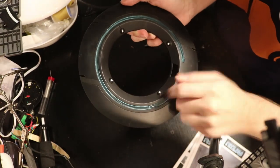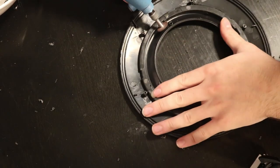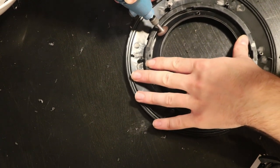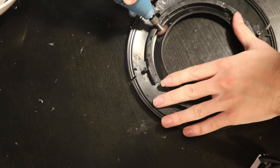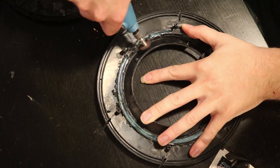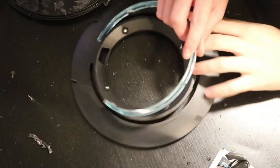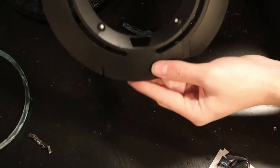The next thing you have to do is take out that original C-ring, because it doesn't diffuse light well. From the way it's designed as a toy, there are only like four sections where the original LEDs go in — literally like four or five LEDs for that entire C-ring, which is ridiculous. We're going to be replacing them with NeoPixel later on. So I went around in circles and really got rid of all of that plastic until the ring popped off. I unfortunately did break the ring — I think that happens with a lot of people.